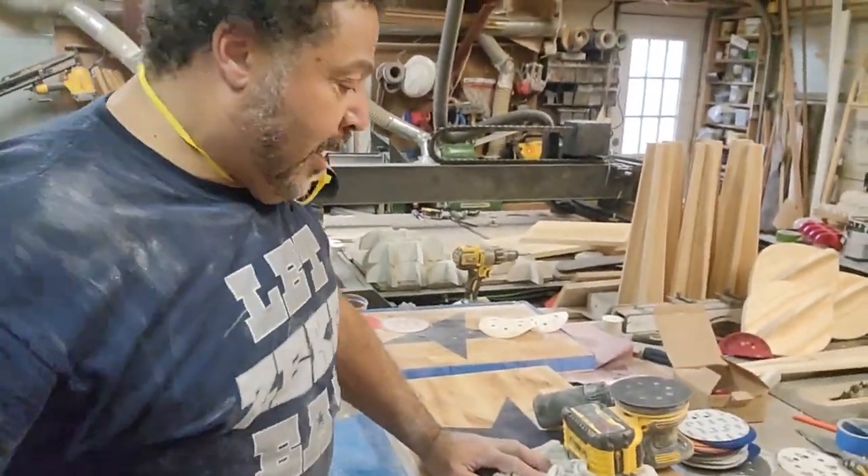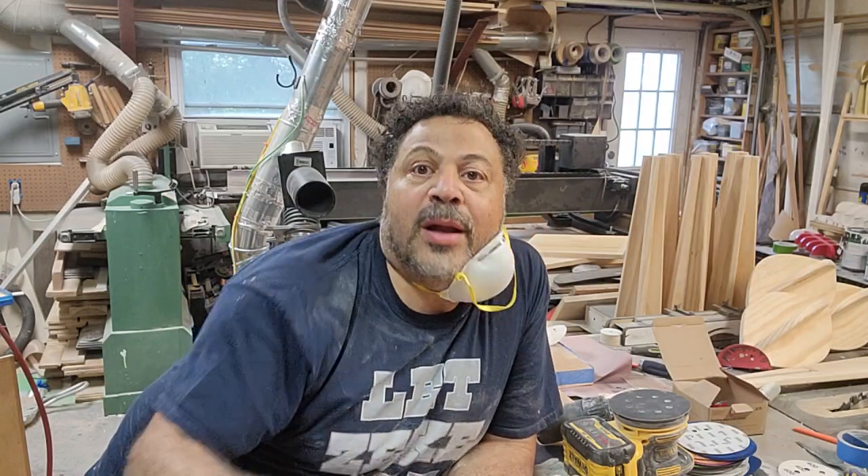And before I get on to Tyler Smith, here's what's cool — sanding. Do you understand what sanding is? Sanding is taking a coarse piece of material and basically scratching the hell out of it. Start out with a coarse grit and you scratch the surface of it. Then you go through and you get a finer grit, so you're scratching out the bigger scratches with smaller scratches. And you continue to progress and progress and progress until finally the scratches that you make are so fine that you can't see with the naked eye.